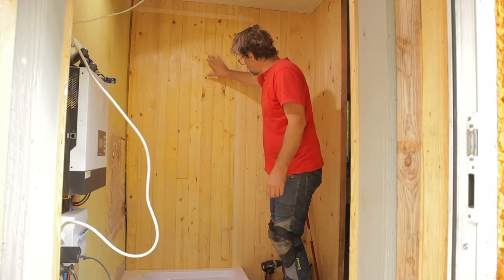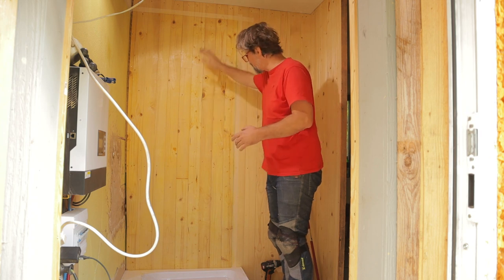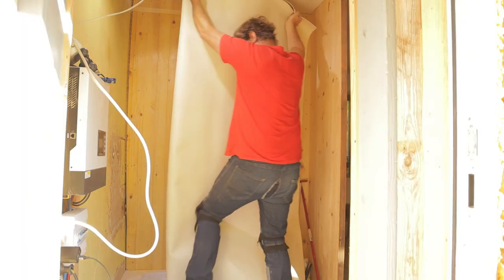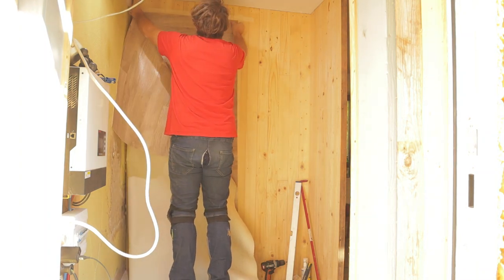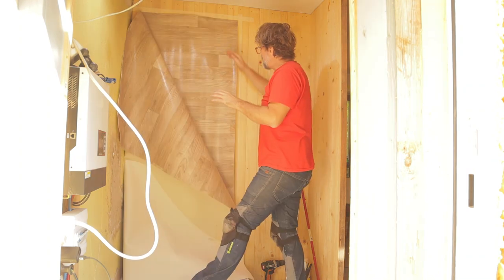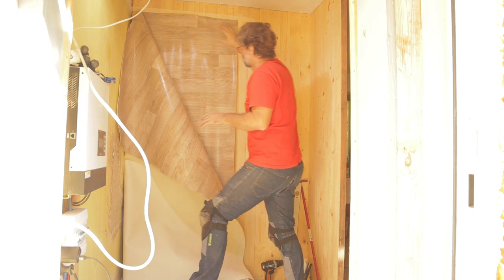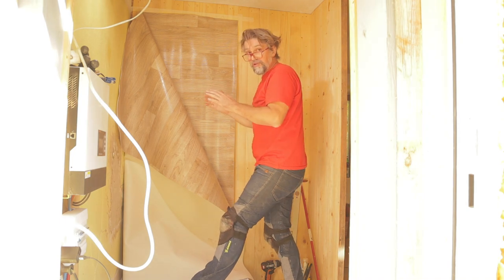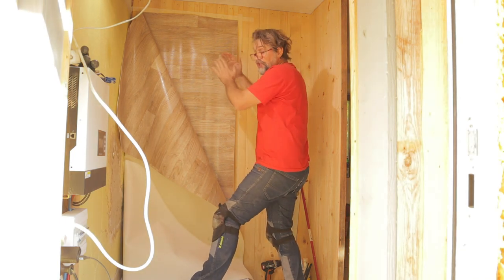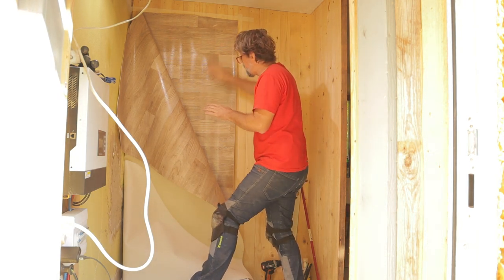Now it's time, it's nicely sticky, and it's the perfect time to install that PVC floor on a wall of the shower. Why do I apply glue on the PVC floor only here on the top? If I apply glue on both sides, it will be too much. You can't adjust later because you must make this nicely flat.